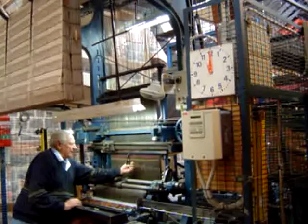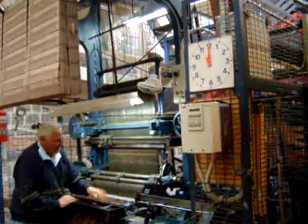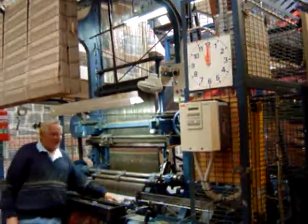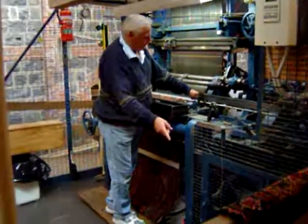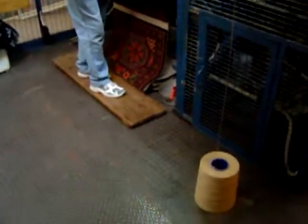The yarn has been cut. Our grippers have swung down and they're now down there like so. Now there's the yarn still in the grippers. It's not part of our weave yet. And it doesn't become part of our weave until this weft needle, that's the needle bringing the jute, has been all the way across, gone all the way back out. Then we'll unlock and leave the yarn behind.